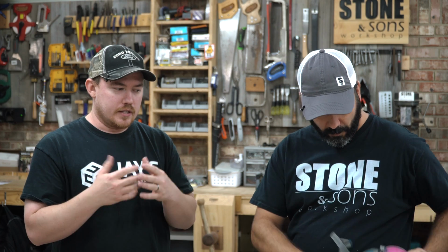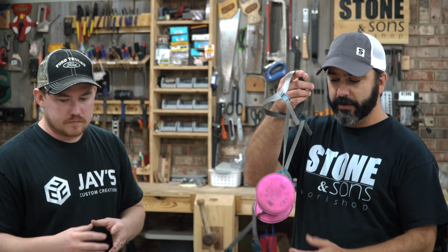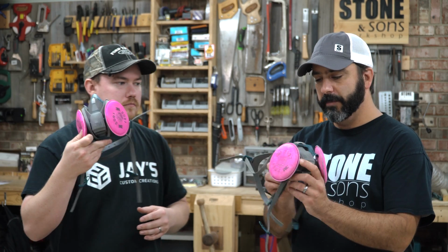Okay, so the next thing he asked about is mask. And so there's a couple of different masks that I think you would want to have in your shop as far as dust, wood chips or whatever you want to talk about. And then also fumes, so if you're spraying and finishing, that kind of thing. Yeah, that was one thing that when I started woodworking, I didn't really understand. There's particulate filters and then chemical filters. So we'll show pictures of what we have set up here, but we kind of have the same thing. Well, yeah, so we both have the same mask. This is also made by 3M.